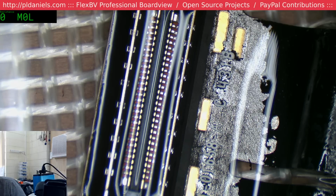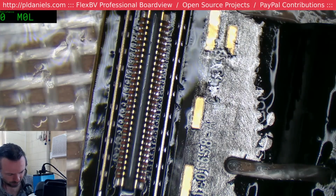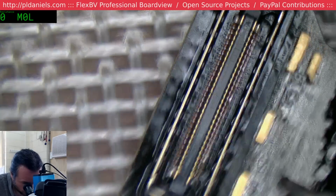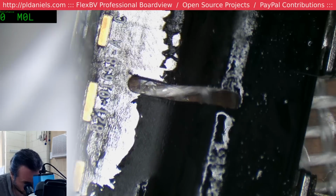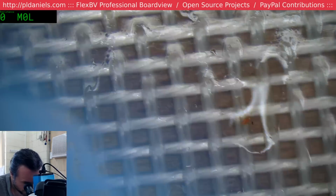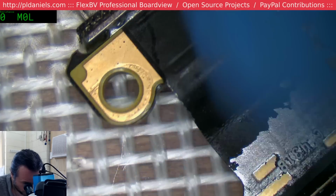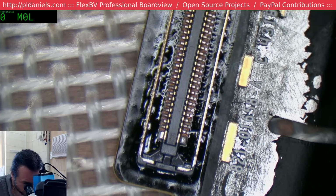Yeah, a world without flux would be no fun at all. Which is pretty much the world a lot of hobbyists live in. Myself included when I was a youngster. You know, you solder it and that was it. And if you didn't get it right, you'd add more solder to get the flux out of the solder. Rinse and repeat, and if you didn't get that right, you desoldered it and tried again. And it wasn't a very efficient way of doing things. What didn't help is that a lot of the time the flux that you could get was either extremely runny stuff or it was like a brick and you had to make it up yourself.